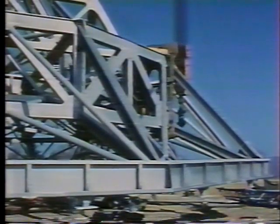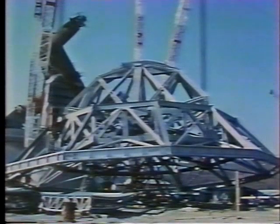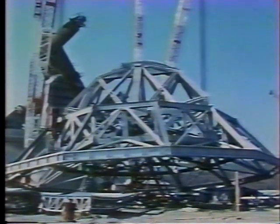It is stopped to be weighed for unbalanced force. "Close enough," says the rigger, and signals the lift to begin. The trick is to raise and rotate simultaneously so that the declination bearings will land on the yoke arm ends.